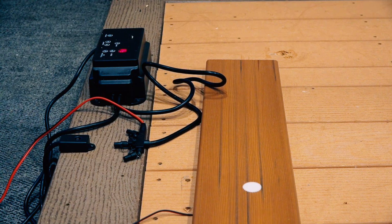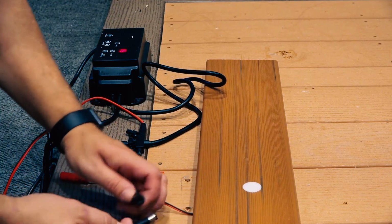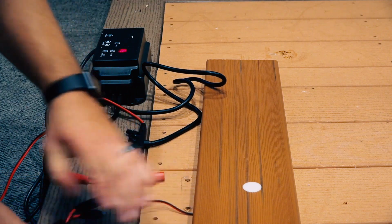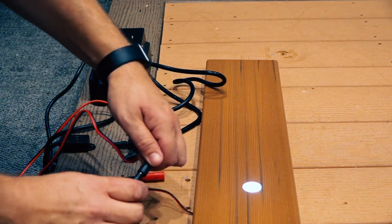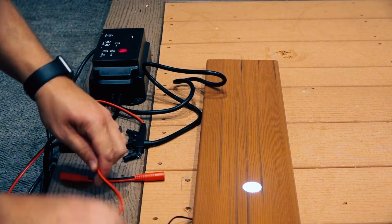Plug a 2-way splitter onto the last light fixture of your installation. Plug an extension harness into the 2-way splitter also. Run enough extension harnesses end-to-end to reach back to the T-connector of the transformer. Use the closed-loop connector to make the connection between the extension harness and the T-connector.